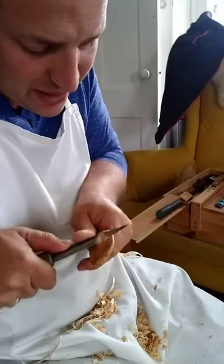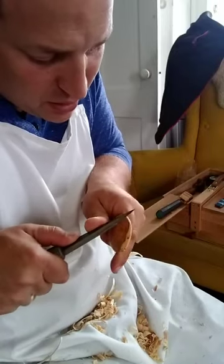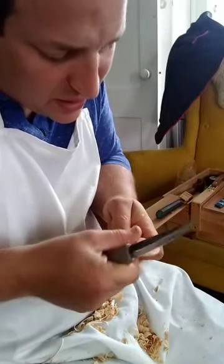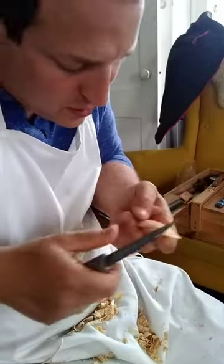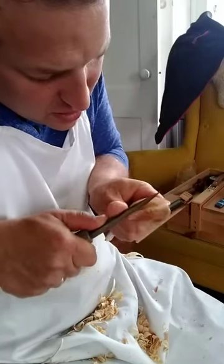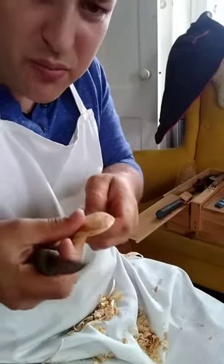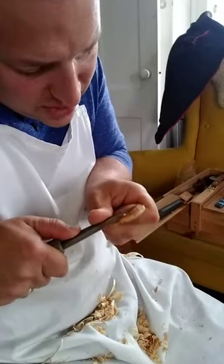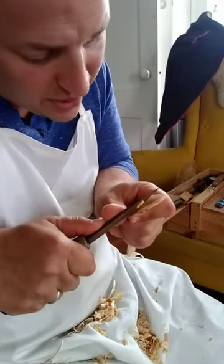This is the only time I hold the knife in my hand at that angle. It wants to ride up and exit out of the wood rather than dive in deep because of how I'm holding it. And that's an important feature that I've only just recently been able to articulate or even realize that I was doing. But I essentially build side-by-side facets that allow me to build down to the rim. And I adjust the curvature towards the tip by how much I lean down in, and I adjust the curvature towards the sides by how many facets I push over and how deeply I go with them.